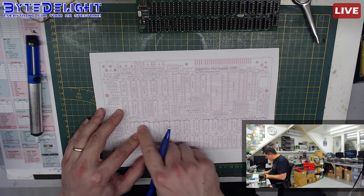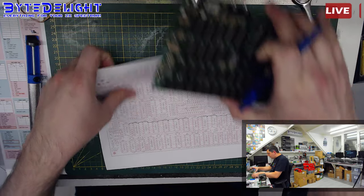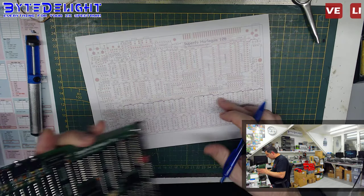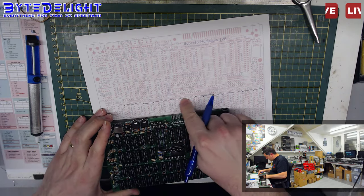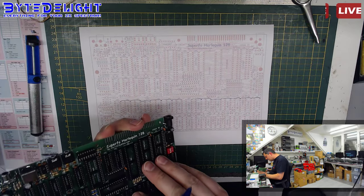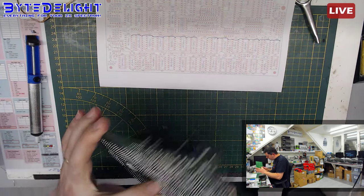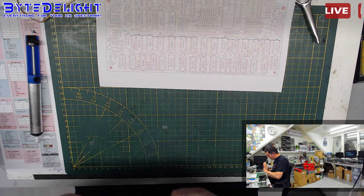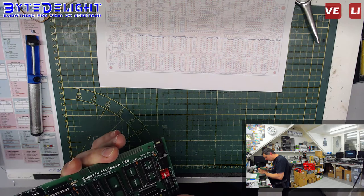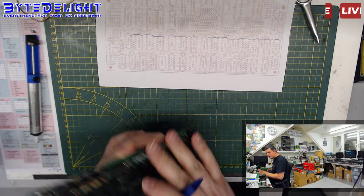And what you can see is a net here, so you see one of the branches of the main 5 volt power line, and the question is, for example, why is there not a connection between there? That's probably because it's on the back. So I'm just checking. Let me check. So it's connected to this pin, I think. Yeah, this pin. There's nothing there. It's odd. It seems to end there, which is quite odd. Didn't expect that.